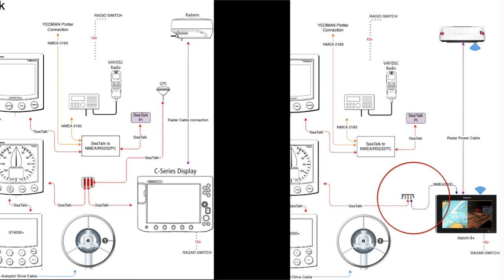If we were to remove the GPS antenna — since the Axiom has one built into the display — the VHF when powered up will lose its position information, so we'd have no DSC on the VHF itself. I've got to investigate that further to understand my options, because otherwise the Axiom will need to be on before GPS is received on the VHF radio.